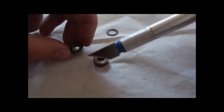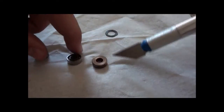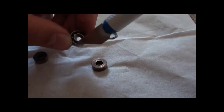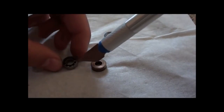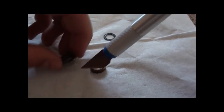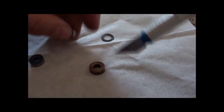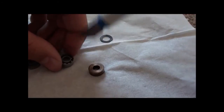You could easily burn out your motor. You can pop off the seals and use a bearing blaster, bearing fluid, or electric motor cleaner to blast out all the dirt and grime inside the bearings. Then you can fill them with marine grease to stop water from getting in and causing rust — though that adds resistance — or use light oil to make them spin faster and more smoothly.